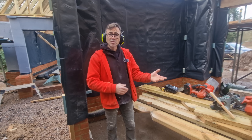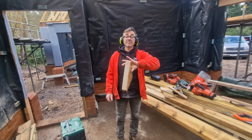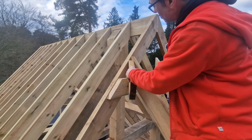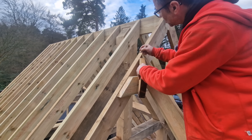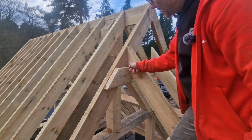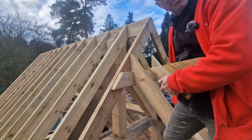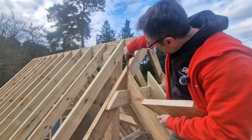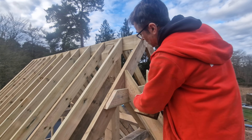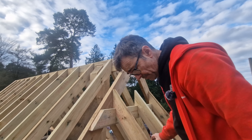So that is one foot. I'm going to do two lefts and two rights, but to mark the lengths we use direct measurement. Using this offcut from the foot, we're going to take that upstairs and it's going to help us set everything out. We need to mark where we're coming in — to get an accurate measurement we want to make sure we can mark our shoulder on either side, which is where the top of the hip is going to come to. I also want a measurement from here down — that's how much bird's mouth we've got to put on to get over the pole plate. It's 155, roughly six inches, which is the same as our margin down below. That will be on the splay too.